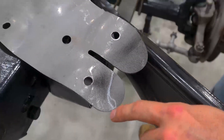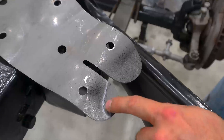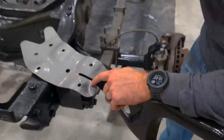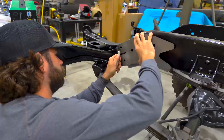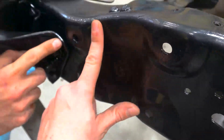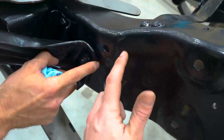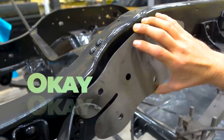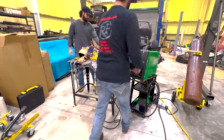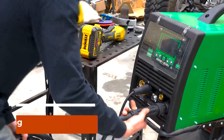I'm trying to keep it rounded — if we cut right there it's gonna be pretty pointed. I'm thinking if we cut it rounded off the weld's going to sit better. We've got to put it right here and we're trying to avoid these humps, so we've got to trim that off. Okay, we're going to go ahead and hook the plasma up and kick this old dog on. Make sure the ground's in the positive.